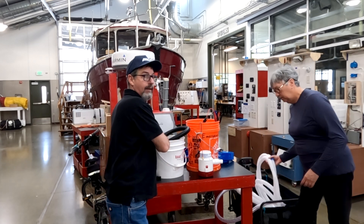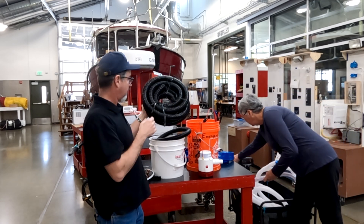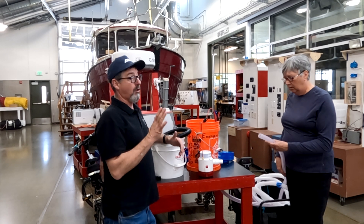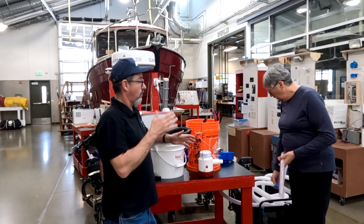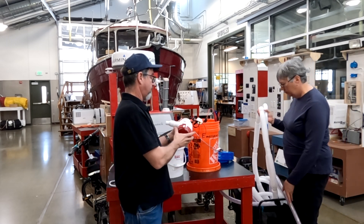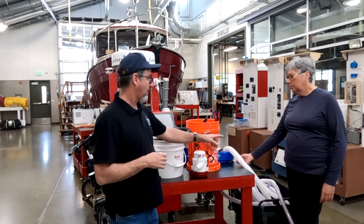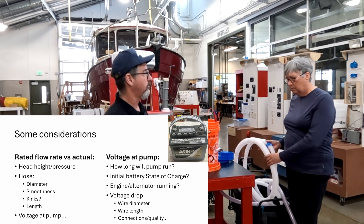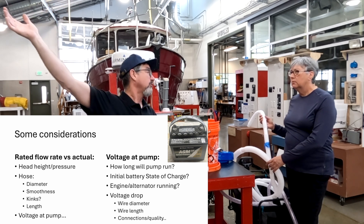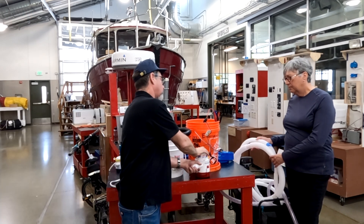There are heavier duty options that coil better. When you get a corrugated hose you do lose some flow. Also, when these pumps are rated at 3,700 gallons, that's pumping flat with a perfectly good battery. Running it through a corrugated hose costs some of that. And if you're lifting it 10 feet from a bilge out of a port light, you're going to lose up to a third or more. But the idea is it's still going to do a great job.